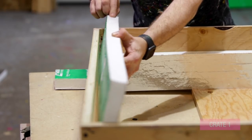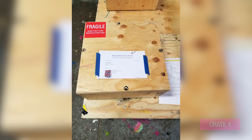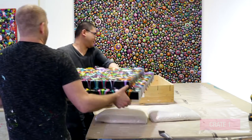You build your outer frame, drill your screws in on the sides, and you've got this nice outer frame. Once your frame is done, you add your styrofoam on the inside liner just with a glue gun, so if something gets bumped the side won't get damaged. Then you've got a face and a back. The backing has got to hold the weight of your piece. So we put a three-quarter-inch panel on the back. Normally you could get away with three-eighths inch or half inch for the back.